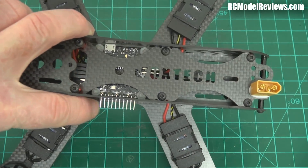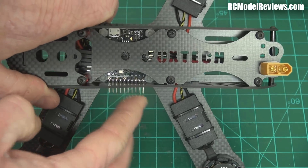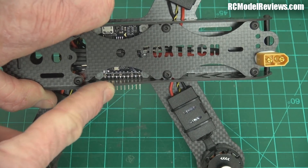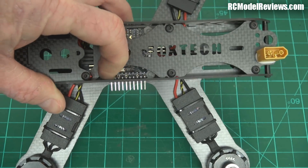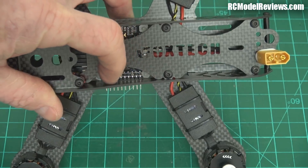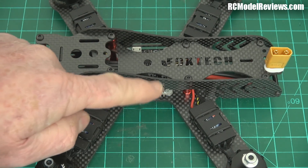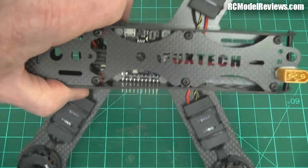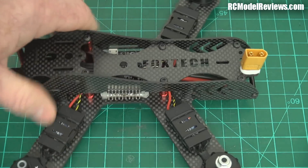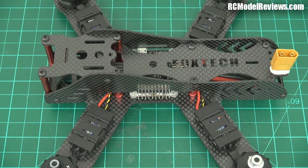Foxtech said that most professional people will solder onto the pins, but I don't think they would actually. I would rather have seen this with no pins at all, because these Version 6 controllers are designed so you can solder wires directly onto the board — they have through-holes, which makes it easier. I'm probably going to end up cutting these pins off and soldering wires on because I only need three: plus, minus, and the SBUS or PPM connector. I think Foxtech should offer the option with or without pins — for plug-and-play people or those who want to do a neater job.